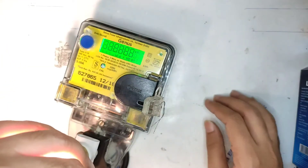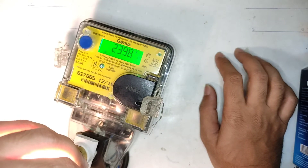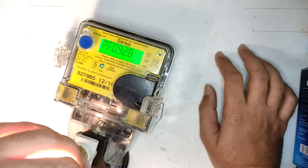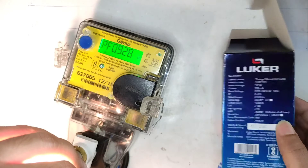It really is bright! The voltage is 240 volts right now — it's a Sunday morning. Current is around 50 to 60 milliamps, staying around 50 milliamps. Power factor is greater than 0.9 — that is also true: 0.928, which is good.